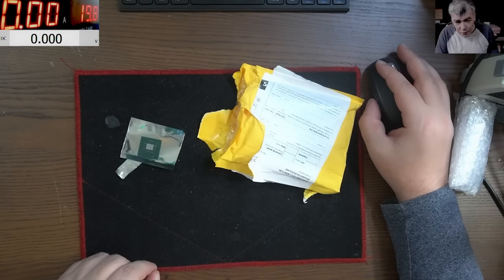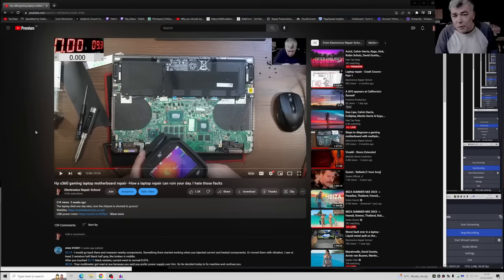You should remember the video. So you remember this video with this laptop, where the real-time clock voltage was held down by the chipset, and the chipset was getting warm in one corner. However, when I tried using the power supply to supply that 3.3 volts, suddenly everything was fine. The chipset stopped taking power and was working for one day. I wrote in the description that the next day the chipset died again, and when I tried the trick with the power supply again, the chipset got shorted.